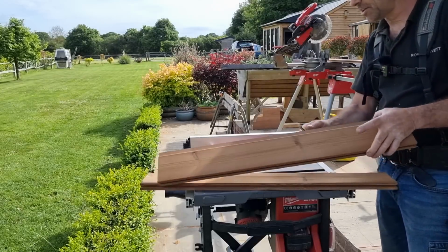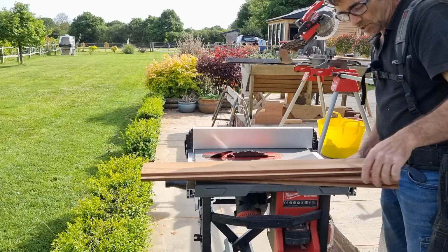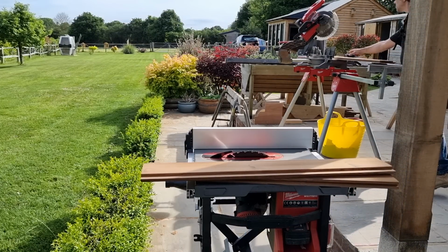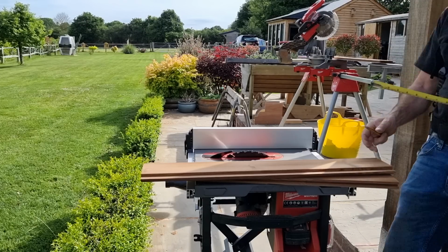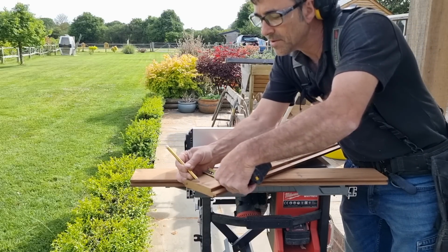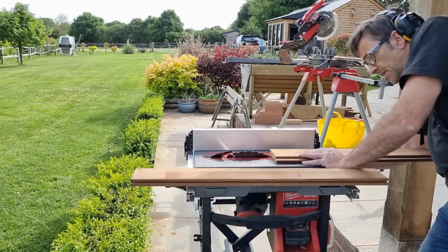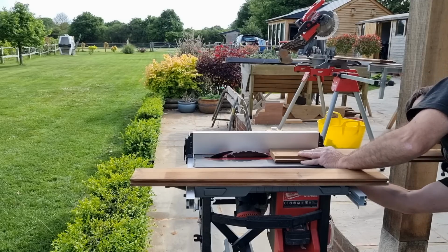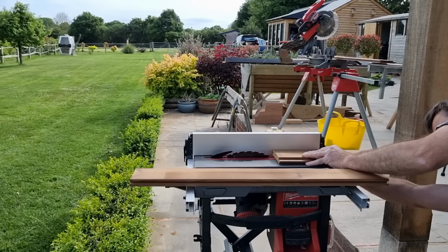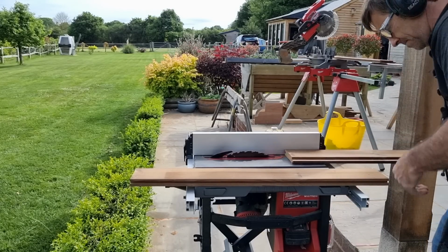So at the bottom, we're going to finish with 2 upright rips, and they're going to be 44 millimetres. So I'm going to mark that on one of these. Let me get my tape measure over on the chop saw. I'm going to mark those on 44, and that's what we're going to rip through. Basically, we'll sight that up there until we're at 44. There we go. Lock him off, give him a try.